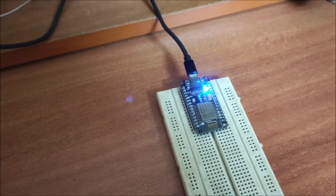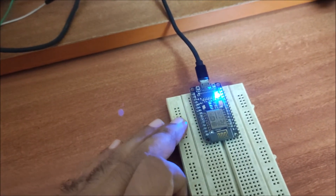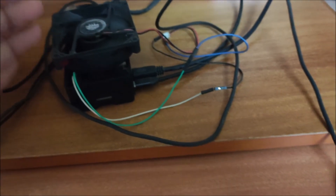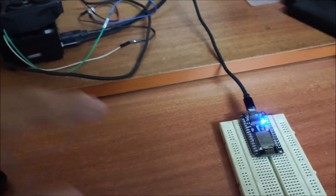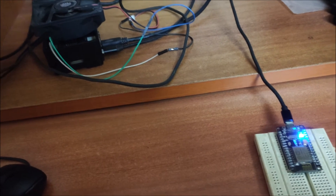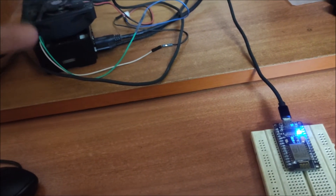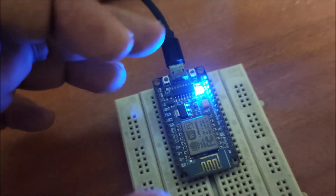Hello friends and welcome to YouTube channel Freedom Tech. In this session, we are going to see how we can install MicroPython on our ESP8266 with the help of Raspberry Pi 4. As you can see, I have connected our ESP8266 module with our Raspberry Pi 4 using a USB cable and successfully installed MicroPython. I am also going to show you how to import the ESP8266 GPIO pins with MicroPython, and then we are going to control the ESP8266 onboard LED — right now as you can see the LED is on.